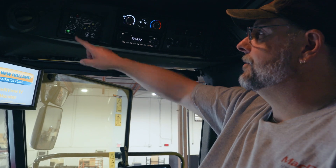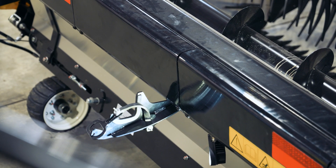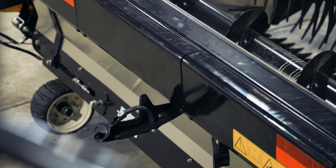To turn on our stubble lights, they're just going to come on with our normal field lights. Our stubble light kit will work with any John Deere configured header as well as Case and New Holland headers, providing they have the integration kit installed. The header is pre-wired for the stubble light kits with all configurations. The problem is that not all combines have wiring to support turning the lights on and off at the multi-coupler. So it is just a simple 12-volt source — if you want to rig up your own power supply, you can have the stubble lights activate on any non-John Deere and Case configured header.